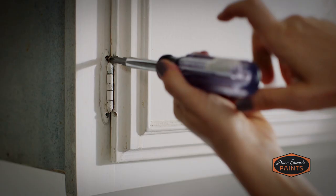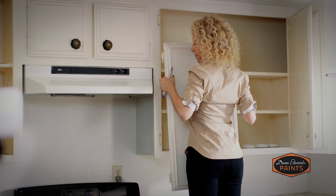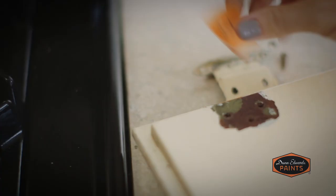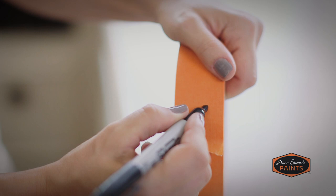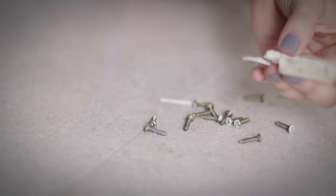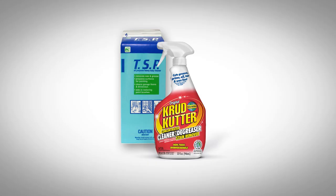This has definitely saved me before. Next, unscrew the doorknobs and remove the cupboard doors by taking the screws out of the hinges and pulling the doors off the frames. Again, place any hardware in a marked baggie. Here's another Tracy's tip: make sure to number the cabinets and doors so that you know which doors belong to which cabinets. Simply take a small piece of painter's tape, mark the cabinet and door with the exact same number — one piece on the door where the hinge goes and the other piece inside the cabinet. Now is also a good time to assess the hardware; any screws, hinges, or braces that look old and tired should definitely be replaced after the cupboards are repainted.